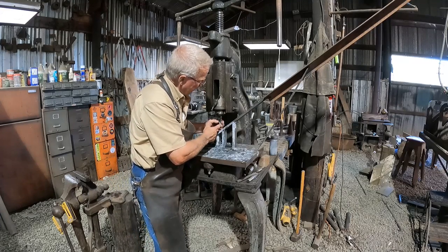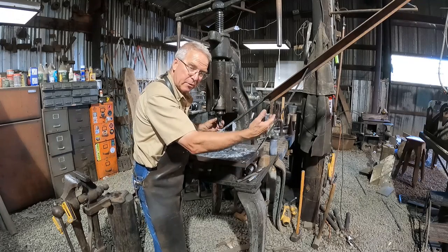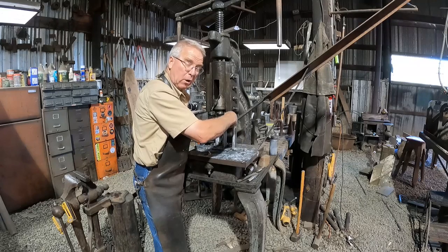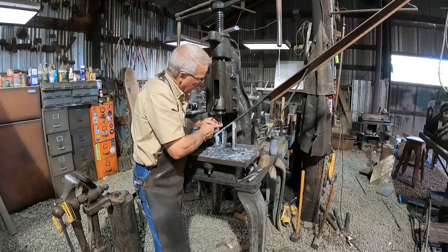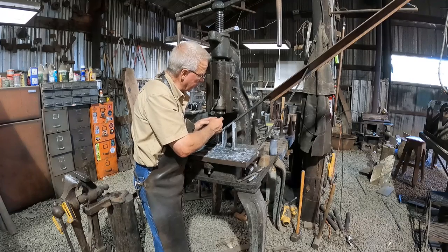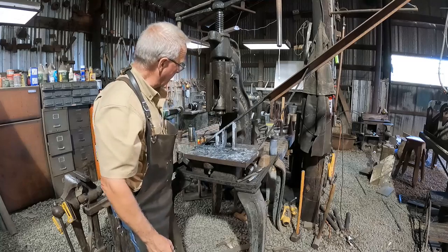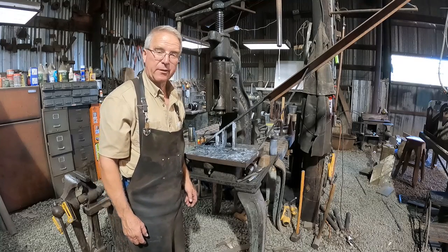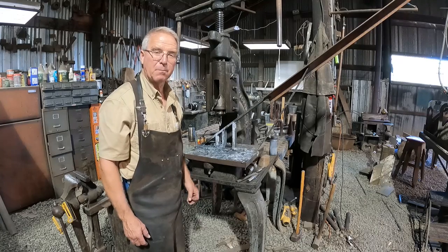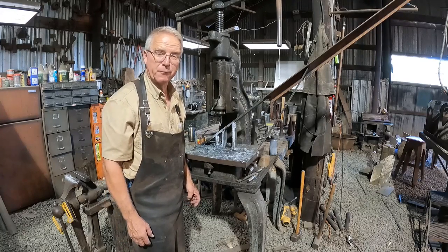I found out that I needed to grind away the shoulders on the square side on the uphill side because that was making contact with the 9/16 hole earlier than the other side. So it's a kind of an offset taper going from the 5/8 square down to the round tip. But aside from that, it worked as advertised and it turned out fine. And so now nothing remains but to just cut it apart, put it in the scrap pile, and maybe someday repurpose it for something else.